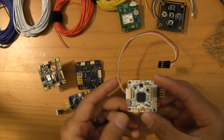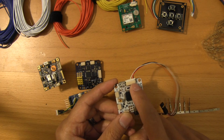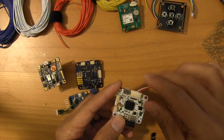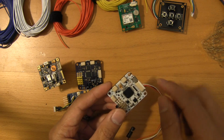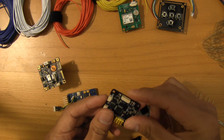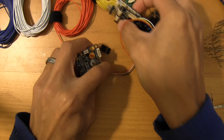And then onto the Open Pilot gear. Open Pilot uses JST SH connectors. If you look under digikey using those search terms, you'll be able to find all of their connectors, and you'll find them in 4-pin, as well as for the Revo board, you'll need a 10-pin housing, but for a CC3D, it's just an 8.